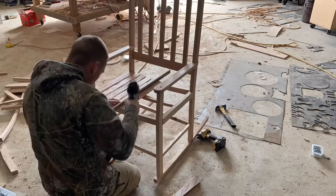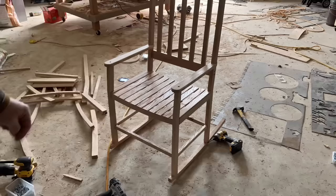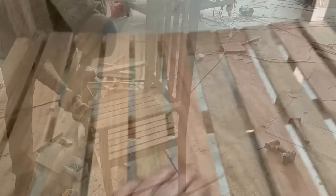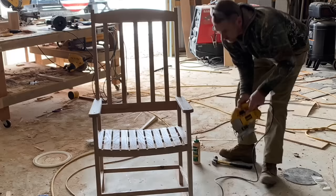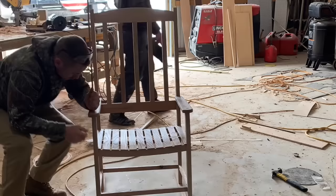I'm going to grab the 22-inch long quarter-inch-thick pieces we're going to use for the seat. I'm going to get a 1-inch finish nail and only attach each slat to the front and back portion, not the middle — you'll see why we cut that middle bracket just about a half inch lower. I used a scrap piece of wood to keep a nice even spacing all the way across. A little sanding finishes it off. That half inch lower middle bracket gives a little bit of spring and more comfort to the seat. Finally, I'll grab the 3 eighths-inch oak dowel rod, put some glue on one end, put it in the hole, and cut it flush — a great way to hide those screws, and since it's oak it looks great and blends well.